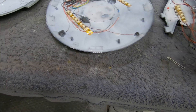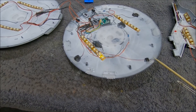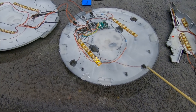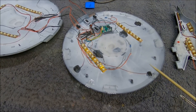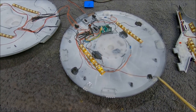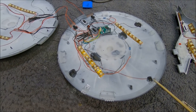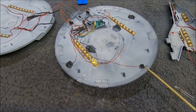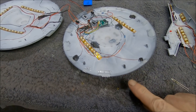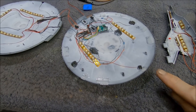The notch serves two purposes: it keeps the SMD from being blocked and stops the light from being cut off, and it also relieves pressure on the wires soldered to the back of the SMD so they don't get pinched. Otherwise, when I went to put the saucer down, you'd see a little bow right there where it wasn't going to lay flat.